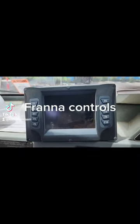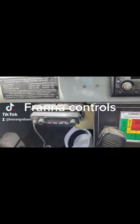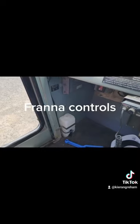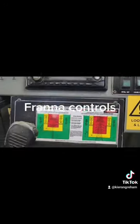We've got our Bluetooth Kenwood stereo and our Robway app — I'll go into that a bit in the next video. Also keep in mind when doing the pre-start that your communications are checked, so make sure you do check them. Down in the corner we've got our washer bottle for the wipers, so always good to have that full. The usual decals all need to be in good condition.